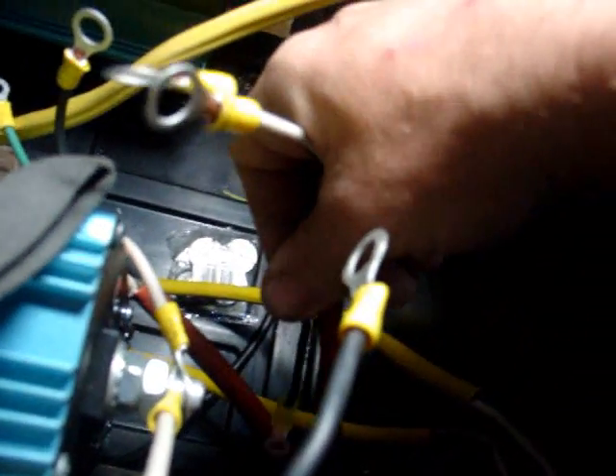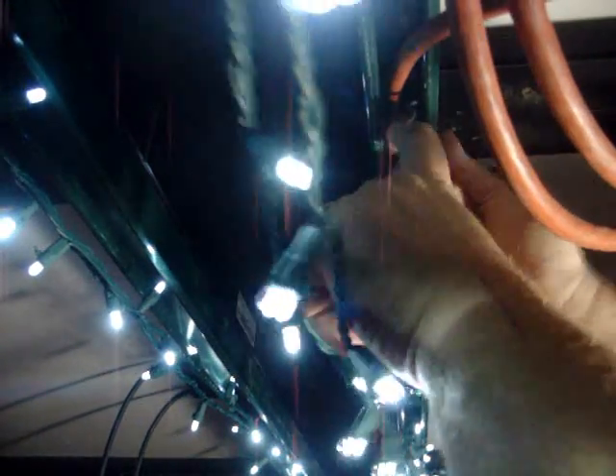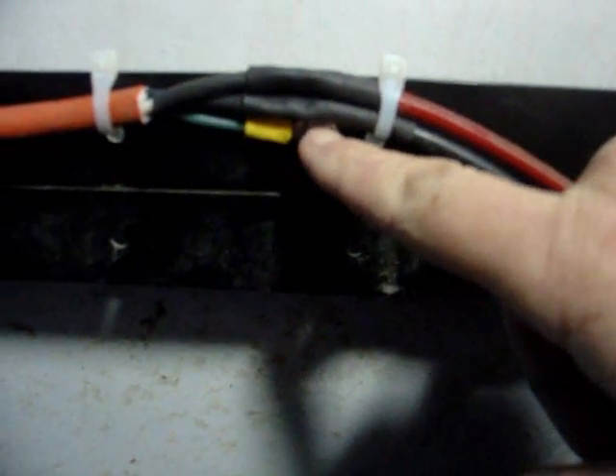This is the one going all the way down to the other end, to the last panel. It goes out the box here, comes out over here, and because it's the next cable I've got it run on the outside here — I connect between two of the cables and come up to one of those holes. I'm going to run it up inside this. Stick it up in there, one side of the clip goes up, the other side goes up, you reach in and press both down into that little trough — locks pretty good. There's the last screw for the ground.